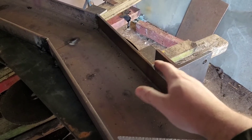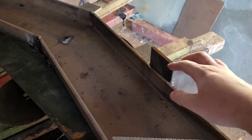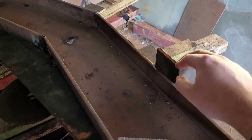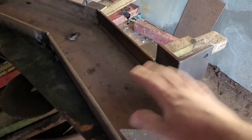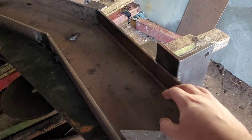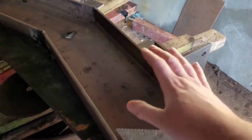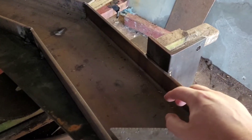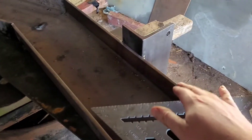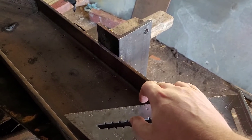So that's the plan. This trick of using them as a jig — getting this flat and doing the next ones on top — it's probably not a new thing, but it's new to us anyway. So we need to get these done now, weld this a bit better — a bit more, I just tacked it while it was in place. So we'll weld this a bit better so it's a stronger hold, then do the next ones, and we can weld the angles, paint them up, and get them out of the shed. It's been quite a while in the making, so it'll be quite nice to get them out from under our feet.